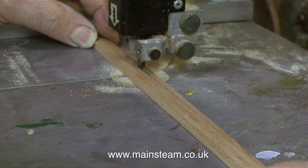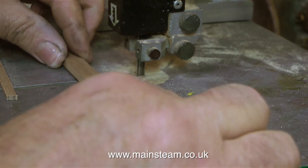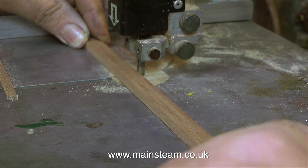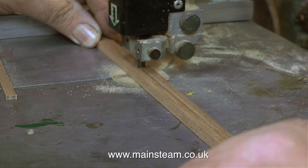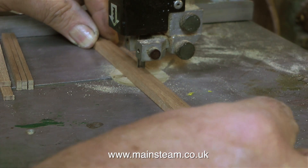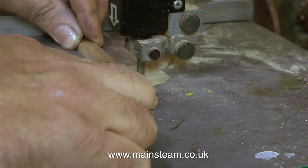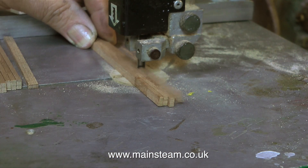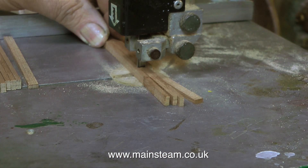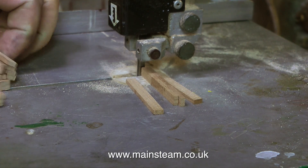Once you have a measurement that works all the way around the condenser, it's time to cut the rest of the mahogany strips to length — but not one at a time. I'm cutting these four at a time, because I'm very confident that the length is going to be okay. I'm still cutting the mahogany strip wood up on its end, making sure that all the strips are pushed firmly against the guide before taking the cut — that way every one of the mahogany strips will be exactly the same length.